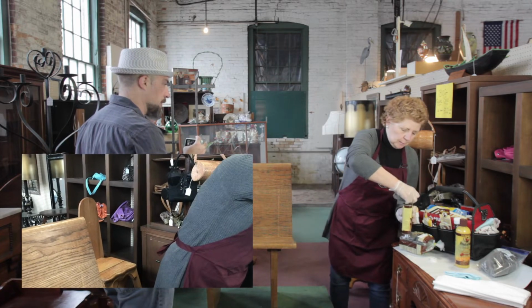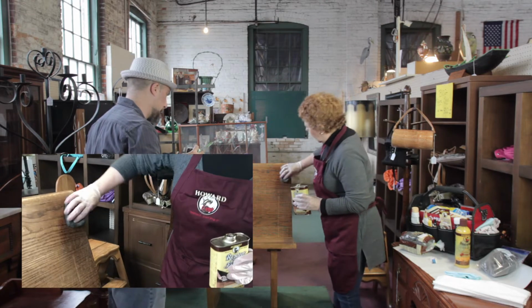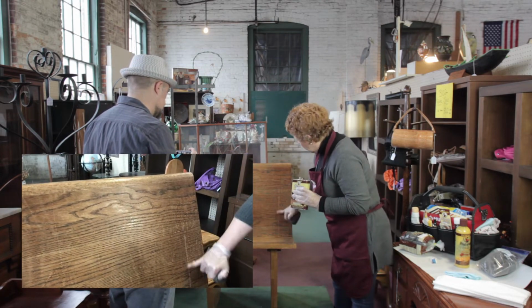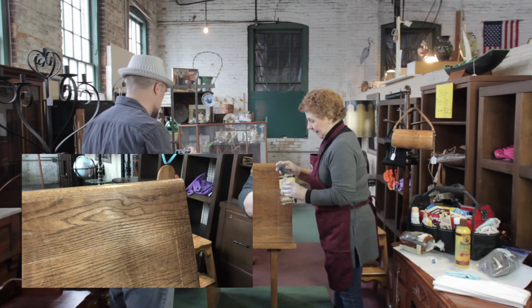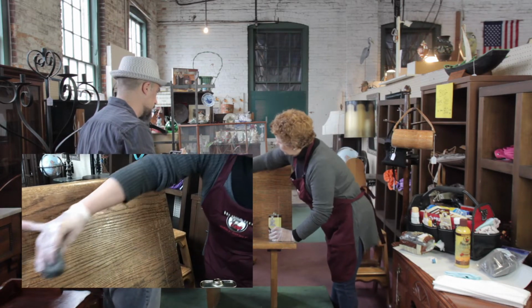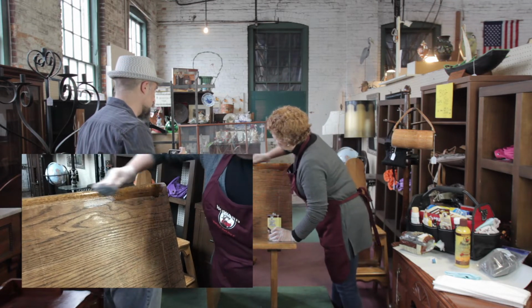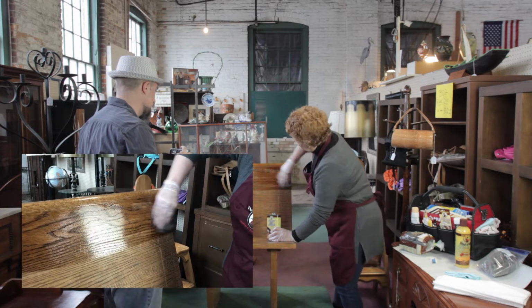See, I wouldn't know that either, with the steel wool, huh? Yeah, and the trick is to go with the grain. Yep. Now you can see there's all manner of what looks like watermarks and discoloration. Who knows what finish is gone. Exactly. It's probably been in storage for a huge amount of time. I saturate this with the product. And this is the grain here, the oak grain, and I'm just going to go with the grain, apply it liberally, and I think you can already see.